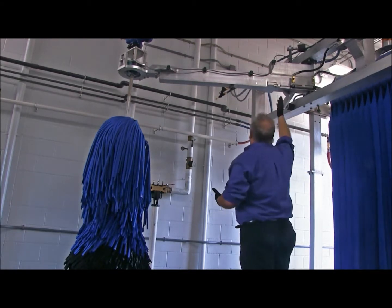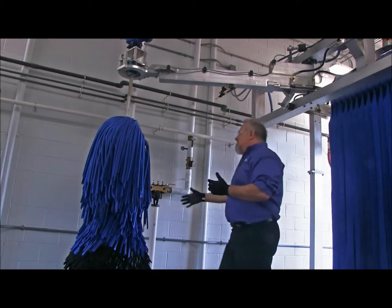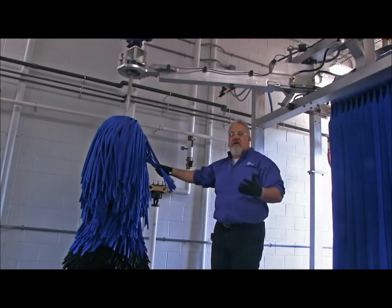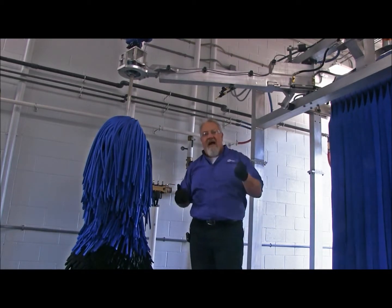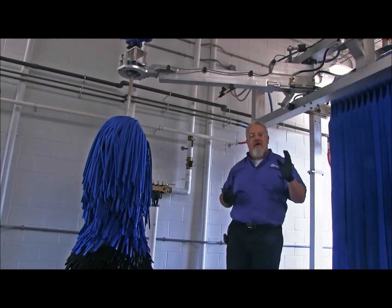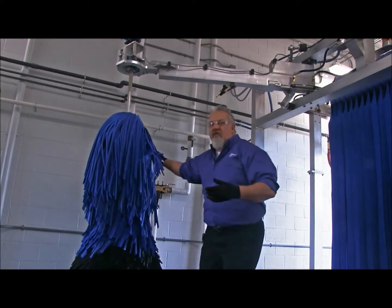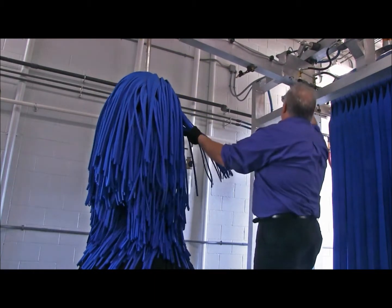If that electrical wiring is loose, if it drops down, as this brush moves in and out, there's a possibility of it getting caught and damaged. So a visual inspection on both the driver's side and the passenger side brush is a critical thing. Take a look at that wiring as it transitions off the top of the gyro and goes down to the arm. Pull the arm inboard to the middle of the bay, and then take a look at it.